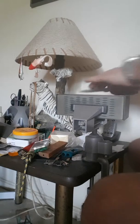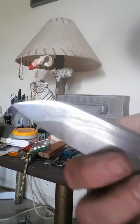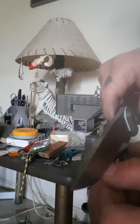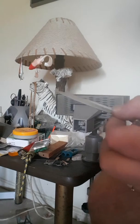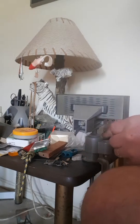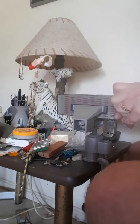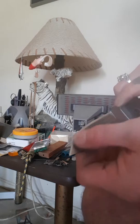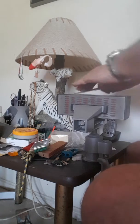Looking at the edge, I think I've got that pretty much where I want. The easiest way I check at this point is by running it across the fingernail. It's as rough as guts all the way across, right up to the tip. So I know that I now have that flat edge that I want. When you go down through the grits, what I'm essentially doing is not taking any more meat off the blade — I'm just polishing it up, getting out the gouges that the heavy stuff left on the edge.